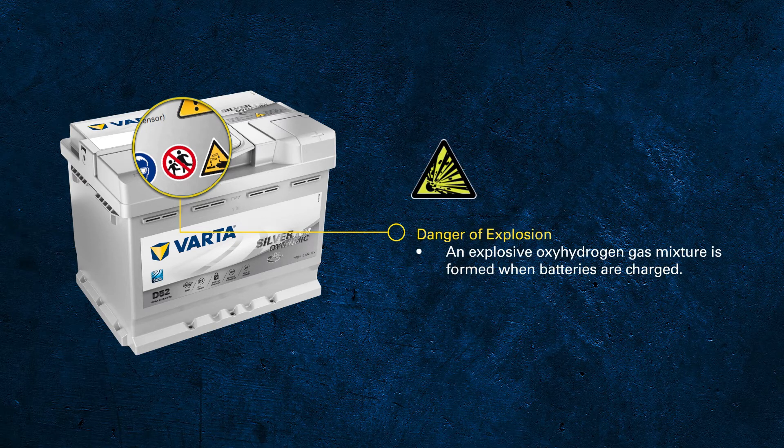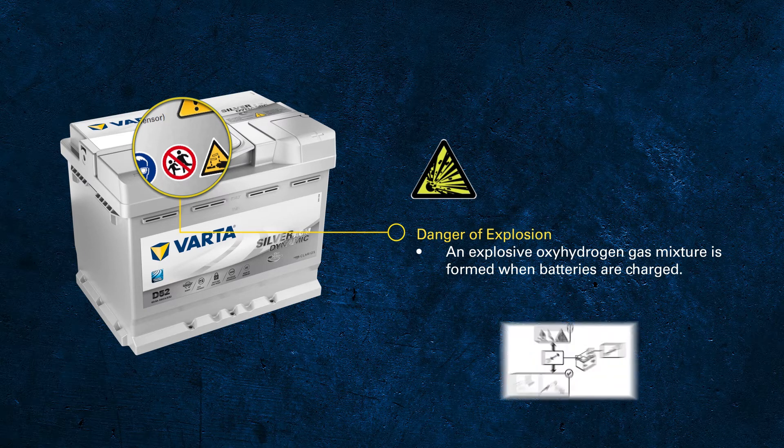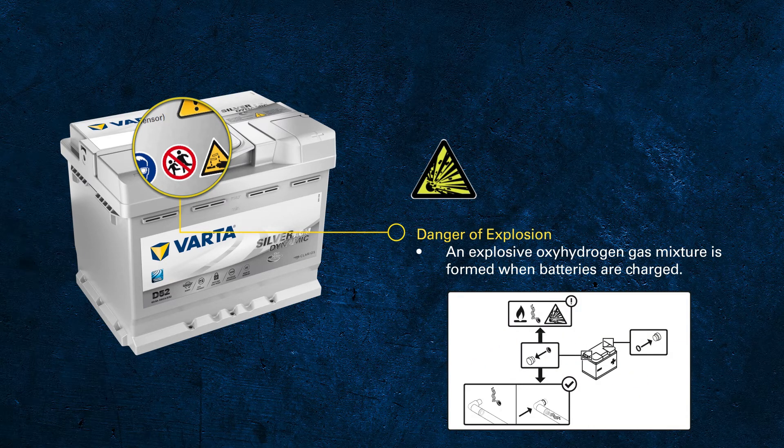When charging a battery, as a side effect some energy is being used for electrolysis, which leads to the production of hydrogen. This is the reason why you must connect the exhaust tube to the battery and close the vent hole on the other side of the battery. Sometimes for logistic reasons both vent holes are sealed with a plug to avoid acid leakage during transportation. It is absolutely important to unmount one of these protective plugs before putting the battery into operation. Otherwise the creation of internal gases will lead to significant overpressure and ultimately burst the container.